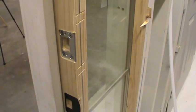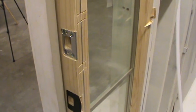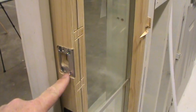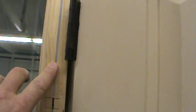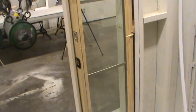Ron Olberding with Edward Wayne Incorporated. We are testing our SL68 sidelighted new construction unit today with our six-hole strike plate. We will attach our decorative strike plate right over the top of this — that's where these two holes are. The SL68 is sandwiched in between the jamb on the strike side and on the hinge side. We've got two screws to each hinge into the aluminum and the strike plate is attached to the jamb brace with thread-cutting screws.